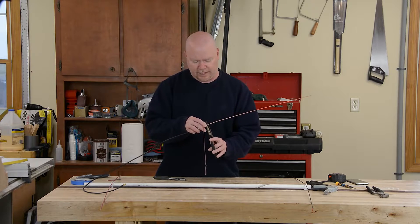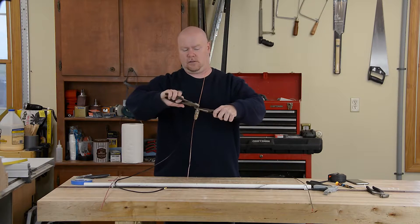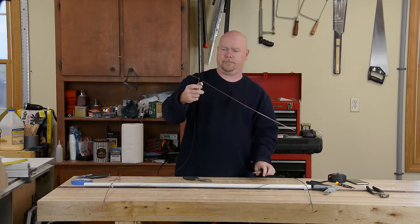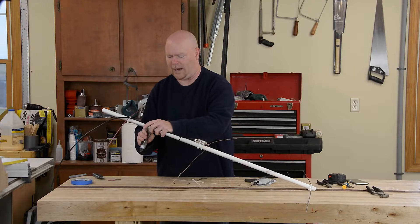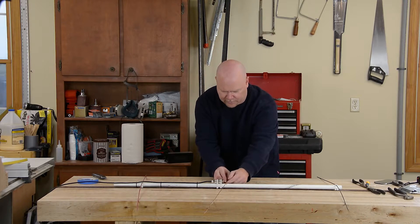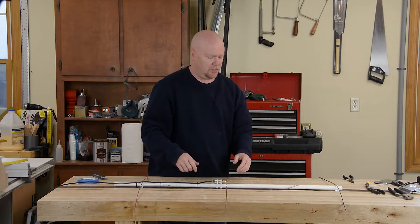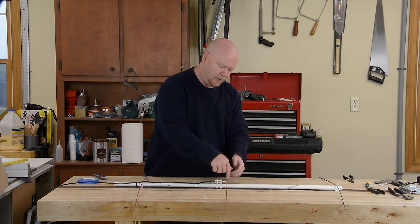The last thing I'm gonna do before mounting is bend my elements to get them in a nice straight line. For the center pin of the driven element, that basically just means bending it at a 90-degree angle. To get the other half to line up, I've got to bend it forward first and then out. I'm also going to tie the wire down along the length of the boom to keep it out of the field of the antenna. With everything attached, I'm making sure the driven element is nice and straight just like the other two, and getting it down as close to even with the top of the boom as possible.